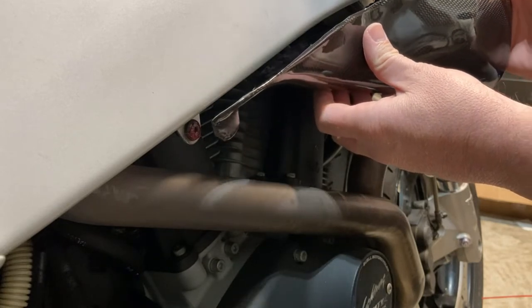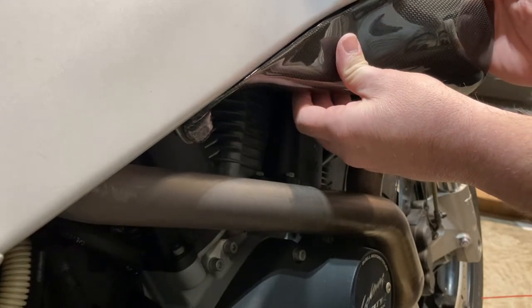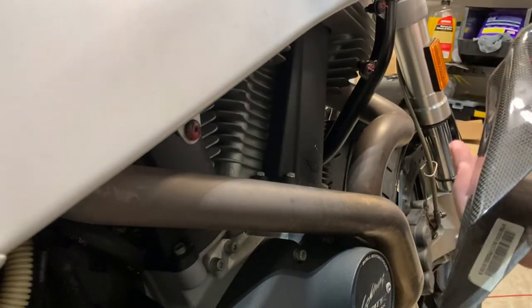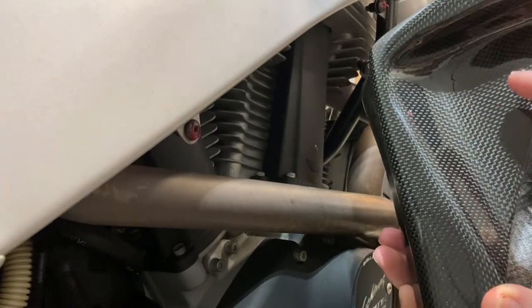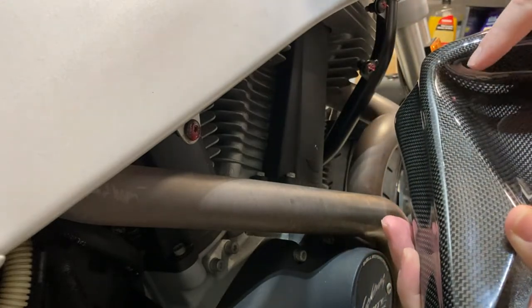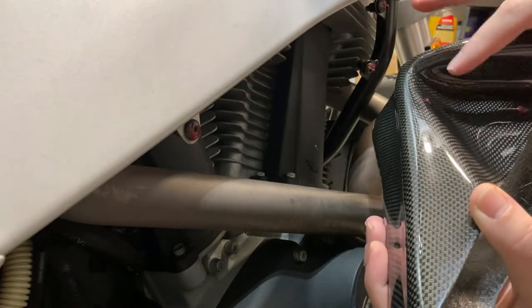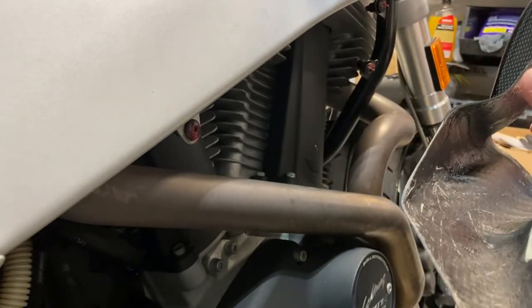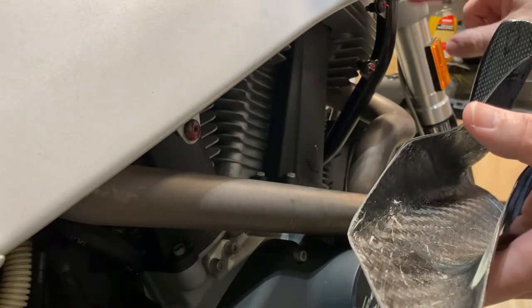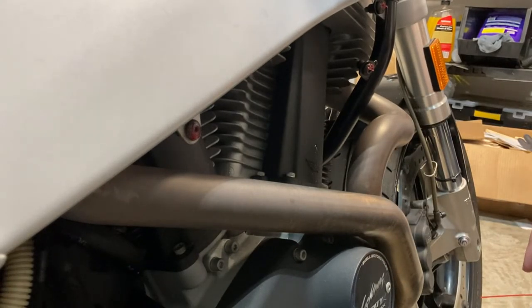What I want to avoid is just smearing it, because that's not going to help me — I just want a quick press and release. There we go. That mark's kind of on the edge, so I'll drill that hole last, but there's that one and that one. I should be able to do a quick drill on at least those two first, and then that one last. I'll have to modify and elongate the holes to get this to line up right. There's quite a bit of wiggle room in terms of how big the hole can be versus the washer size of the bolts.